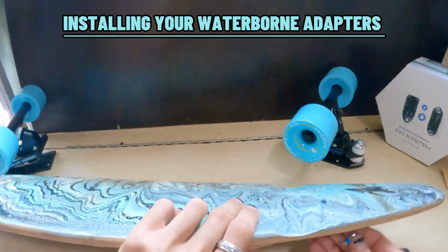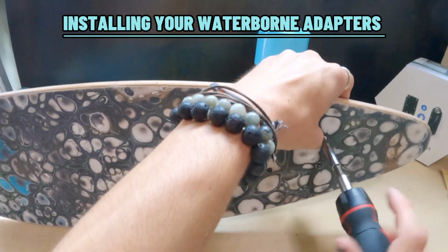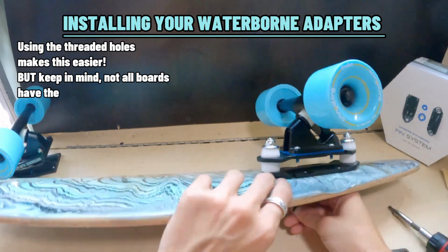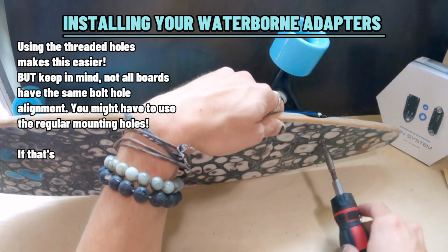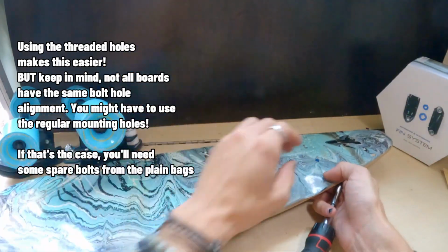But on this board, the holes don't actually line up with the threaded holes on the rail adapter. So, again, using the threaded holes does make this a lot easier, but keep in mind, not all boards have the same bolt hole alignment, like that here. So you might have to use the regular mounting holes. If that's the case, you'll need some spare bolts from the plain bags.